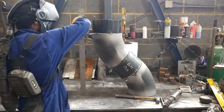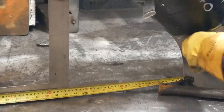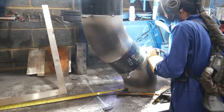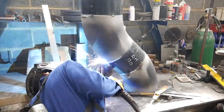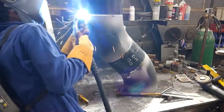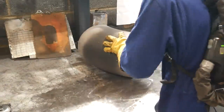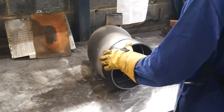I like to do my piping in stages, so I like to tackle my prefab together and then move on to welding all the pieces at once. The pipe and fittings I'm using are Schedule 20, and the minimum welding requirement is a Class 2. I grind over my tacks rather than cut them out — in some cases I do cut them, but for the most part I just grind my tacks down and then weld over them.